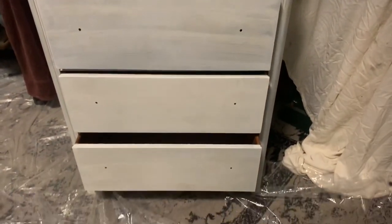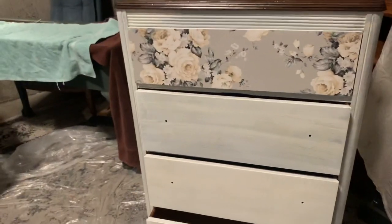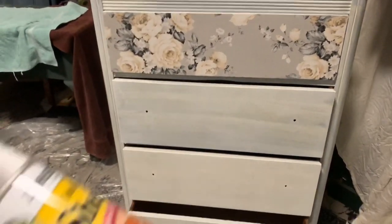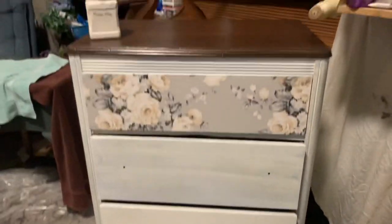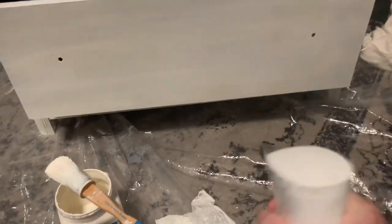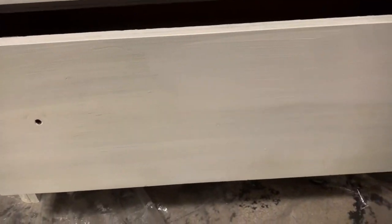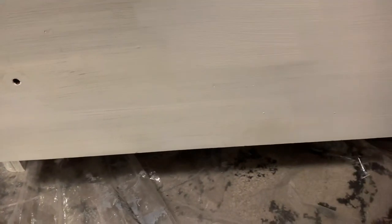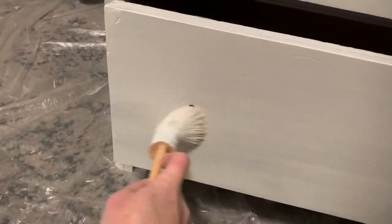This was a little upsetting — I still had bleed-through even after shellacking. On the parts that just came through, I must not have got a heavy enough layer, so I'm just throwing it on again. Hopefully I got everything I needed to with the shellac this time and we won't have any more bleed-through. We're going to go ahead with the second coat and see how it turns out. I did start off with a mist of water, just because it helps everything glide more easily.